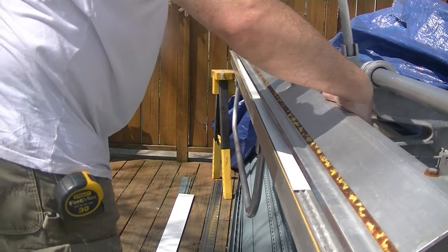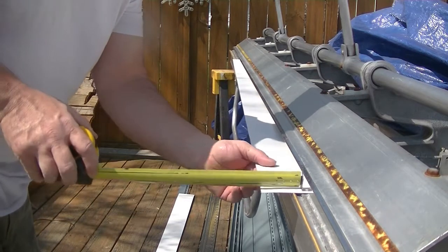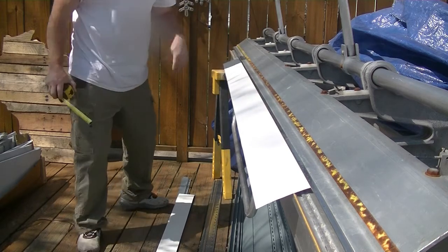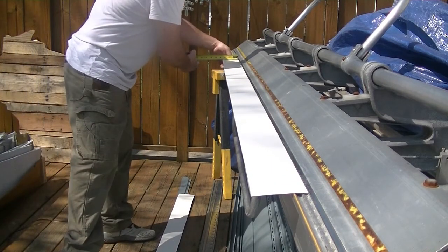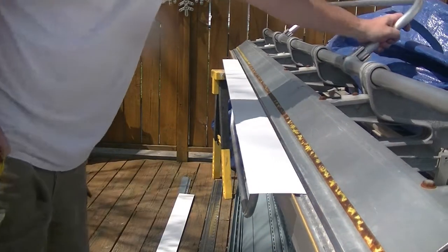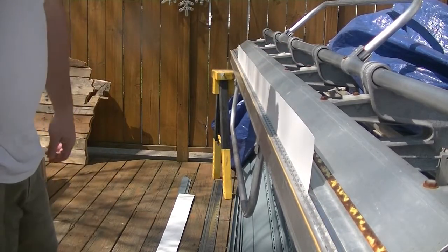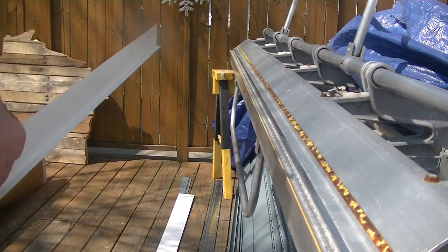And what I'm going to do, I'm going to bring the other piece that's also 4 inches forward, and I only need 3/4 on the back. It's always a good idea to have the larger piece bent up and the little piece in. So I'm going to start lightly locking it down, 3 1/4, 3 1/4, and I have 3/4 left behind. This is where my 90-degree bend. And just a little bit over to make sure it locks in tight. Lock it. There's my bend. I'm going to do the same thing with the other one. This will be our gable fascia.